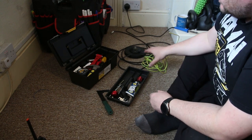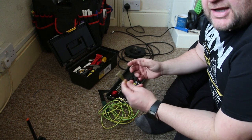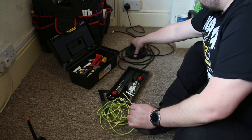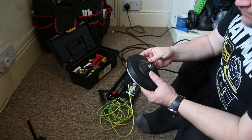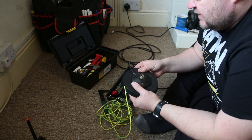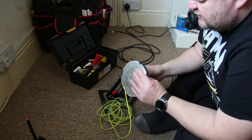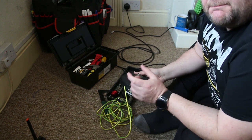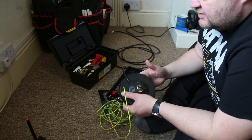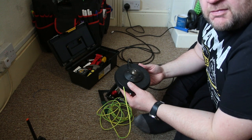Yeah, so guys, we're going to get some electrical wire. Need to make an earth, like I said in my last video, to get my SWR down. And this is the mount I use. It's a serial mag mount, but is it the best option? Probably not, but I went over Sandpiper's aerials yesterday and I want to get a boot lip mount. And yeah, look, my car, and he said there's no way I can mount it, so this is the next best thing actually. But obviously, because my SWR is quite high, I can't get down, especially on 80 meters.